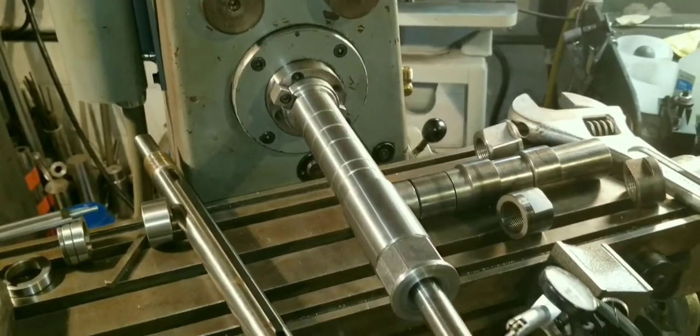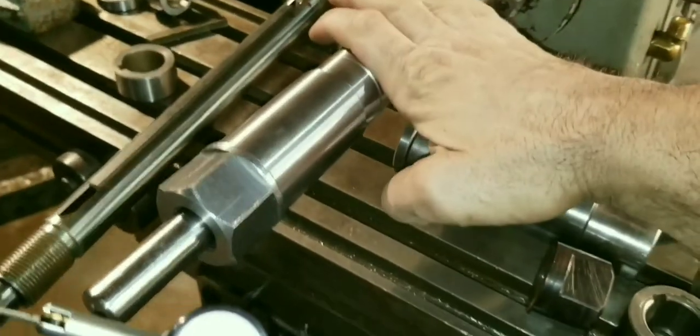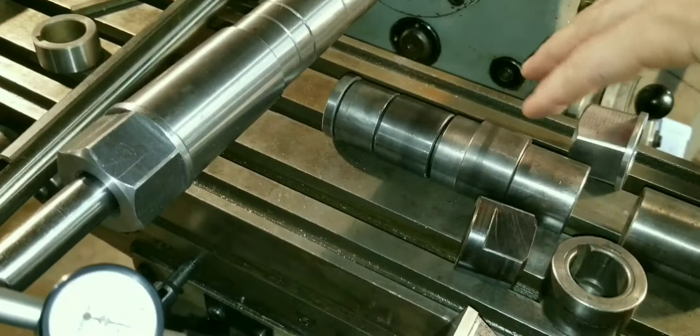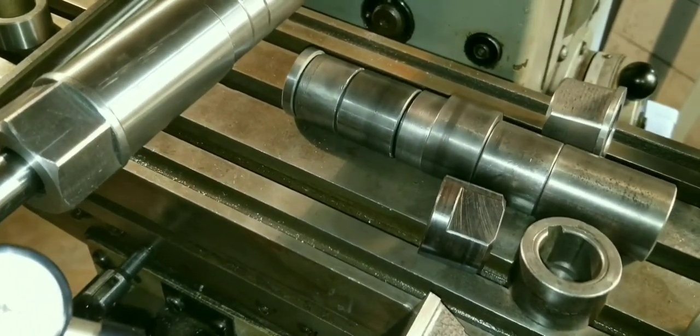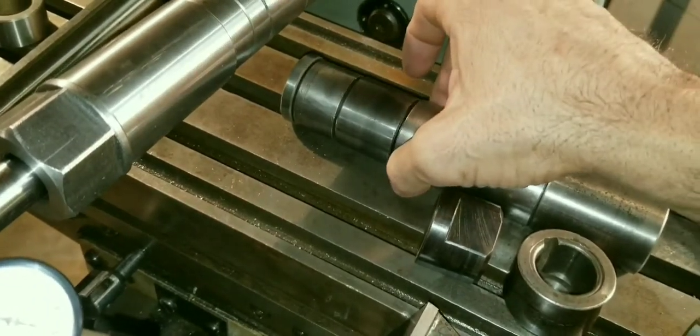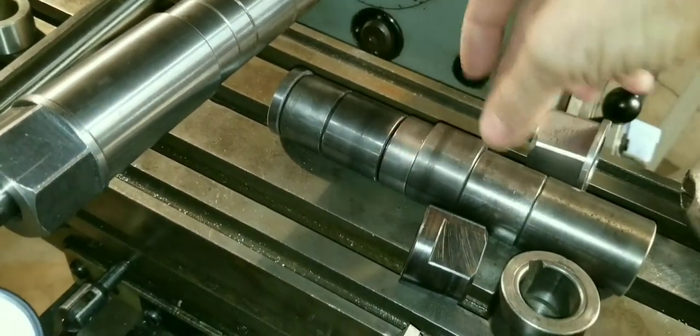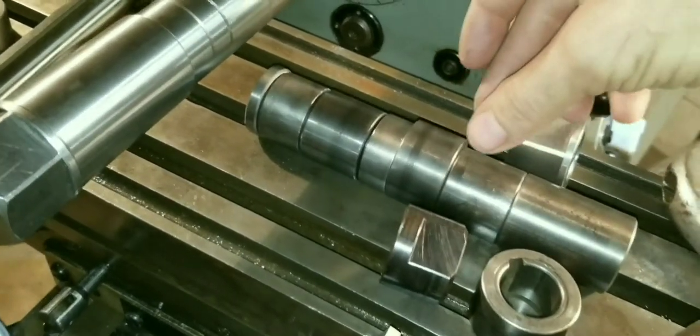Hello, this is the arbor that I've been rebuilding. I put these on to diagnose it because when I put the old ones on, it was wobbling something awful. And as soon as I seen a wobble, I knew what it was — it was these two homemade spacers in here, this one and this one.